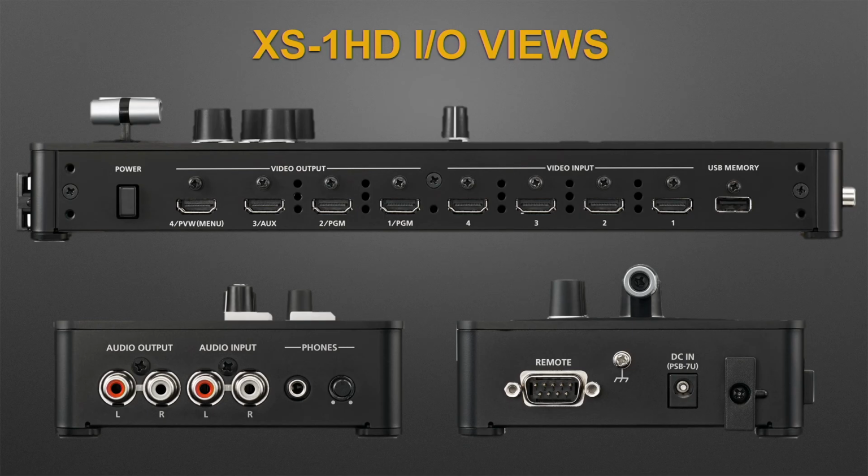And then you have 4 outputs depending on the mode. So for the matrix mode, 1, 2, 3, 4. And then for the split mode, they're all the same. And then for switcher mode, 1 and 2 are program. 3 is aux if you're in aux mode. And then 4 is a quad preview multi-viewer with the menu overlay. That said, you will see the menu overlay in output 4 in all modes, including matrix and split.